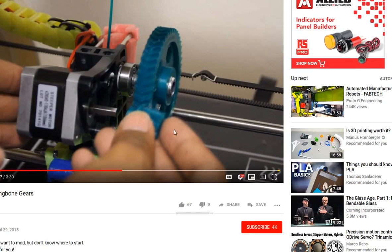And then of course you get into the idea that if you do lost PLA casting, you can start turning that into metal parts. It could be a base that you might have to finish machine later on, but if you're almost there in a shape, it's called near net shape, where it's close to the finished shape, that is a very useful thing if you can do that in metal.